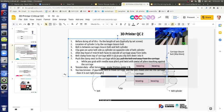First we used friction clamps, like wedges, to wedge the belt in. That gets hard because you have to be very precise on the size of the wedges. They can easily be too small or too large. The belt might get loose, or it's too hard to get the wedge in the first place. The threading of the belt with these clamps is actually not easy, you have to cross them in a certain way. If you're under stress, at least for me, your brain can lock up. We had another way to do it, and we moved to this. We're claiming that the former way was even harder.